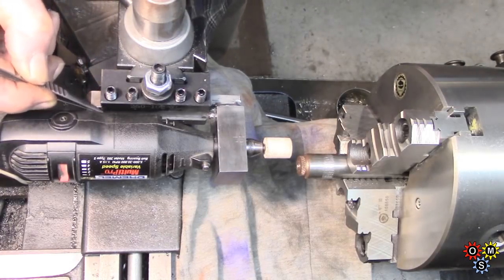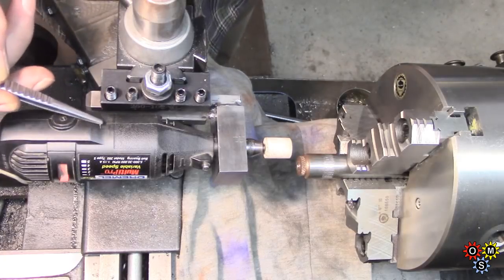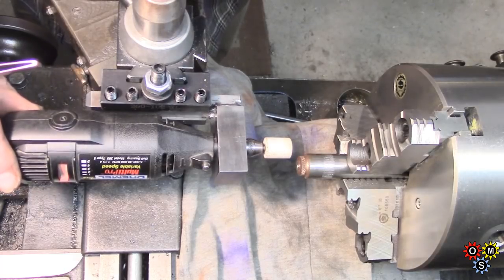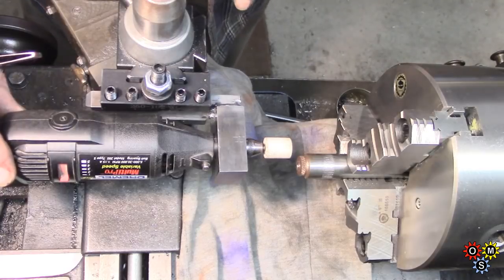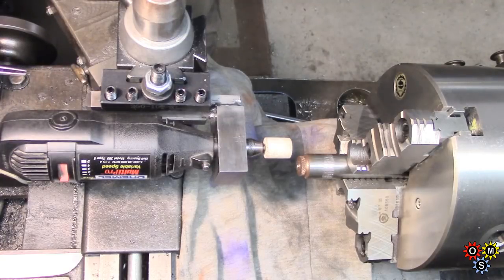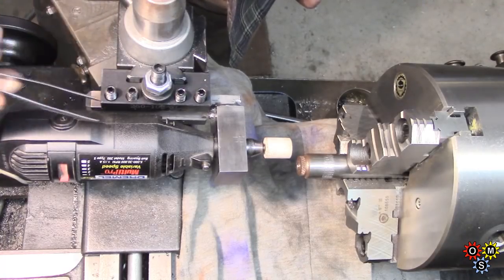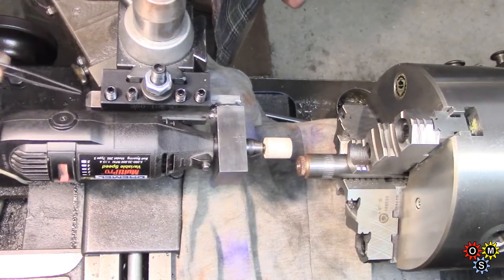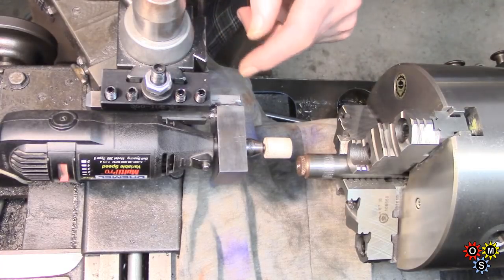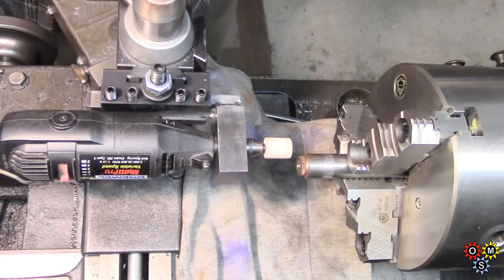But the other thing that does need doing is in this space, that I need to make a shim, and then we'll have a hose clamp, because at the moment there's a little bit of movement up front. Of course, plastic thread into steel is flexibility, so I need a shim which is probably about 1/8, something like that, so we can fill that space and hose clip around there. It may or may not be adequate, but it was worth a try. I look forward to getting some decent abrasives. Test it properly.